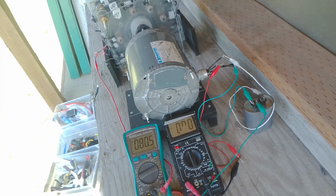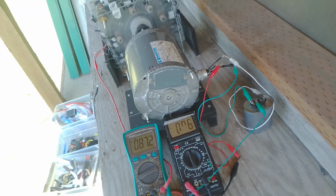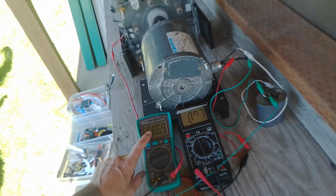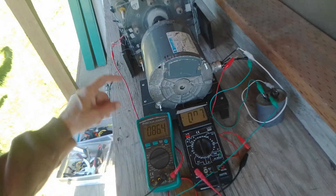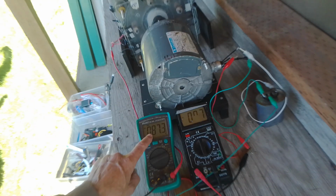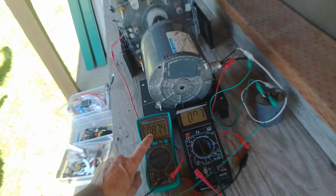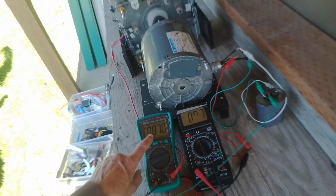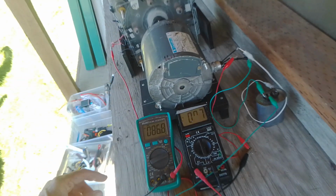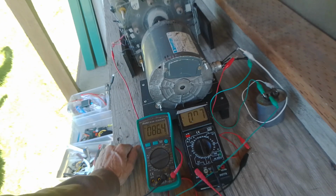Whoops, I accidentally unplugged it. Okay. Let's get down to business. Now here's the generator coils, it makes almost about 87 volts. Also, I could have 1, 2, 3, 4 more coils for about 30 more volts than this, but there's only 7 coils. It's made for 9, there's only 7 coil positions, but 14 coils. It's coils on each side of the rotor. But I could have 9 coils there, if I wound some more coils. The coils are about 4 ohms apiece, maybe if anyone's wondering.